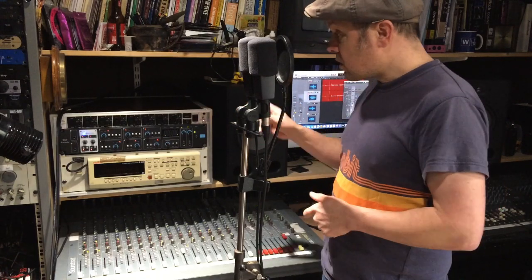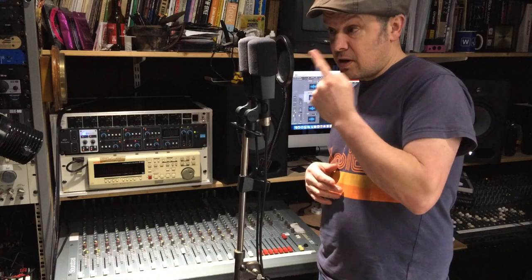It's important to understand what a signal is. It starts life analogue. These two AKG C414s that I've got set up here are each outputting an analogue signal, and somewhere along the line it's digitised before being stored on computer. Likewise, when it comes off the computer, it goes back into the audio interface and out through a pair of analogue outputs, which feed the speakers here. The output of the speakers — a piece of rubber and card moving backwards and forwards — is analogue. It does exactly the opposite of what the mics do: the mics pick up disturbances of the air; the speakers disturb the air themselves.